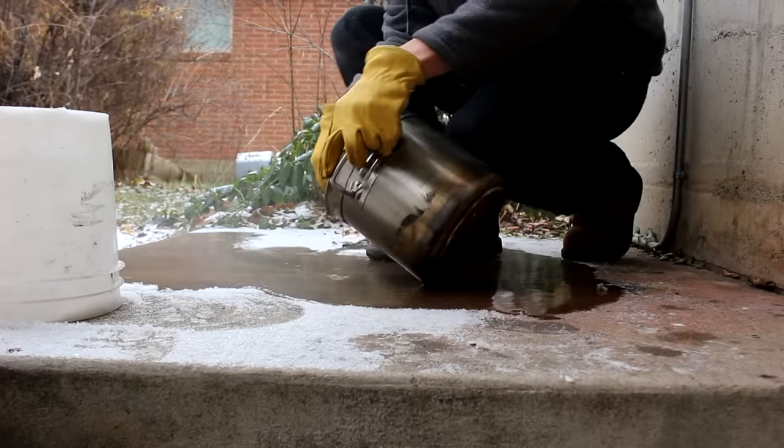Now, the critical gas is still compressible. You can still compress it, but it's very difficult to compress. The ideal gas law is almost completely useless at this point. In order to halve the volume, I've got to quintuple the pressure, or in the case of ethylene, possibly even more than that. Which is why I had so many failures on the ethylene gas.